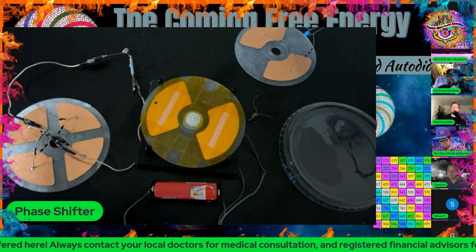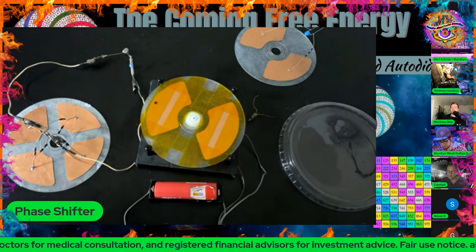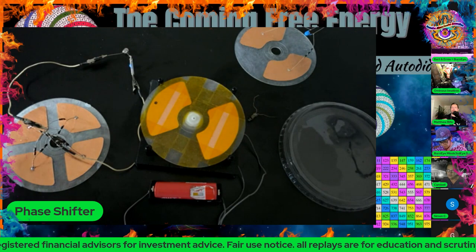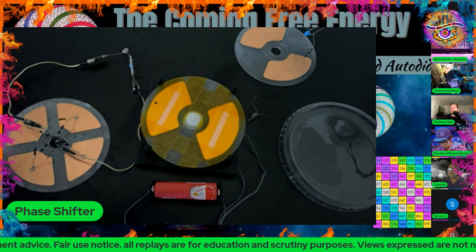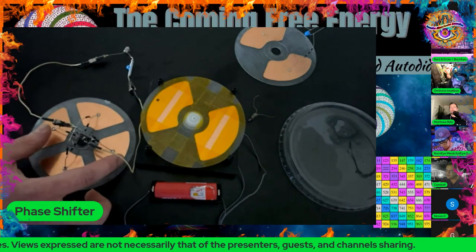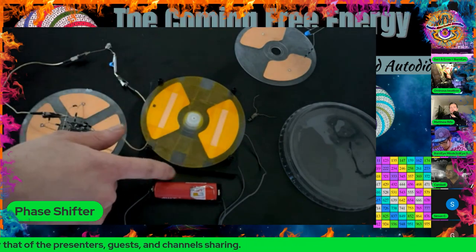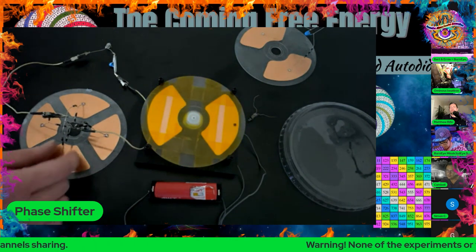But it drags it with such an incredibly insignificant amount of energy that I'm really surprised with how minimal the return is. But here's the funny thing. Like I mentioned, with the tuned LC circuits and depending on your loads, you can also get it to motor. So you could, say, have these plates charged and disconnect the motor power completely, and you could induce an alternating current high voltage into these plates back and forth and electrostatically induce rotation into this plate. And with a tuned LC, that's exactly what we intend to do.